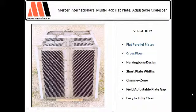If we're steep and we have a flat plate design, there are no nooks and crannies. If you look at the other designs we looked at today, lots of nooks and crannies — lots of places for the solids to lodge. Once solids lodge in a plate, they grow off of each other and the fouling goes much more quickly. A cross-flow design — in today's marketplace, all the real designers go with a cross-flow design.